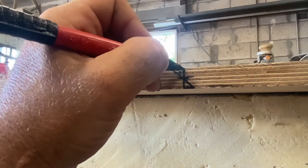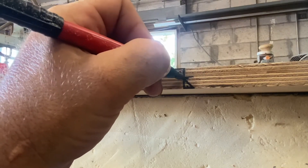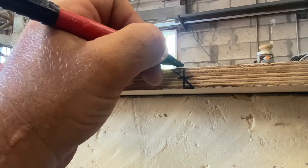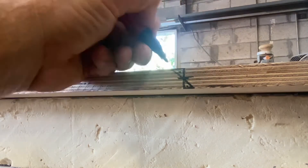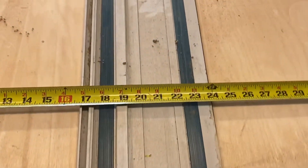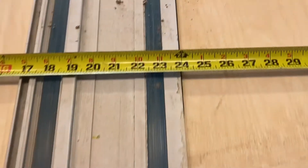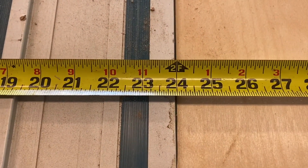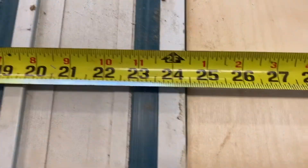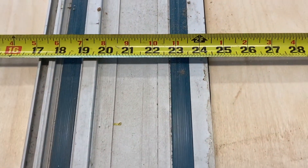All we need to know is that this side and this side are equal. So that means that if half the distance here is three eighths, then the distance from our mark to where we need to cut is also three eighths. I'm just going to take my track that was originally laid out to 24 inches — which would have been halfway across the piece of wood — and add three eighths of an inch to that. So we're going to go over to 24 and three eighths exactly.